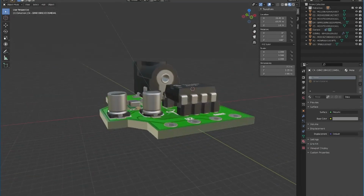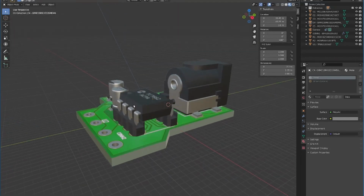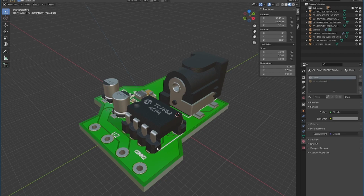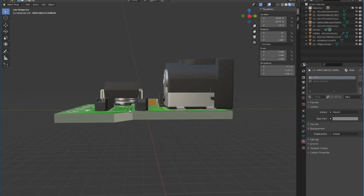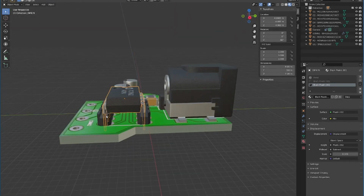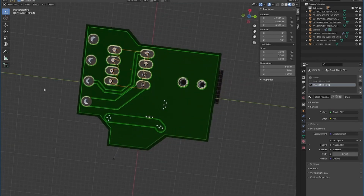Okay, here's the design in Blender, and here's what I've done to the chip. What I've done is, this isn't a socket that it's in. I've taken the plastic shrouds from 0.1 inch pitch headers, flipped them over and inserted the pins through them so as to raise the whole chip up so that the pins of the chip are pretty much flush with the bottom of the board, which keeps it a through hole for ease of soldering, but allows it then to still fit flush.